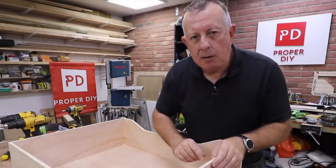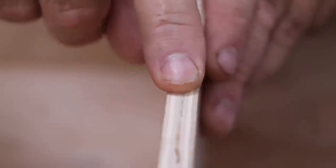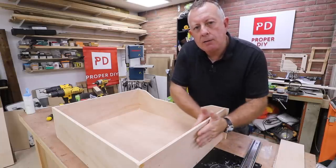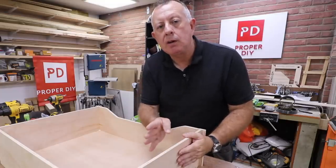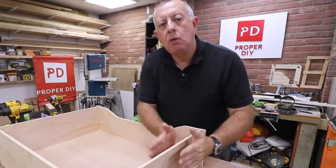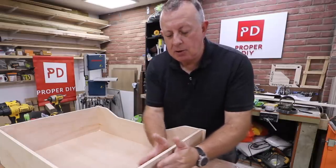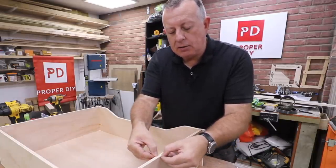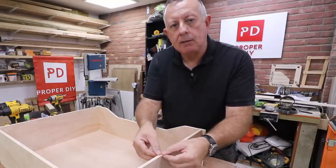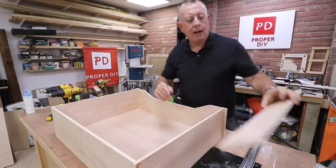In every plywood sheet, there'll be an odd number of ply layers. In this one, there's 7, which means the two outside sheets are both going in the same direction. That means there's 4 in one direction and only 3 in the other. So the direction with the grain is always stronger. Secondly, those two outside sheets are furthest away from the centre, and the further away from the centre they are, the more effect it has on strength. So you learn something every day.